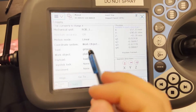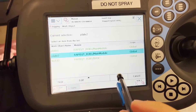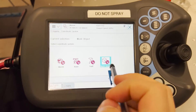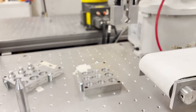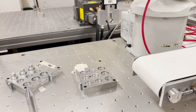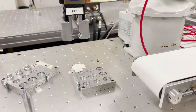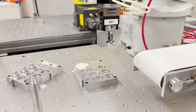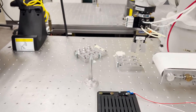This can be seen from the jogging screen. You change your active work object from plate 1 to plate 2. Press ok. Leave the motion mode as linear and make sure that your coordinate system is set to work object. Looking at the plate 2 work object, we can now effectively jog the robot in the positive X, positive Y, positive Z, and negative Z directions. This will allow for easier mobility within the two work objects.